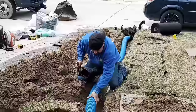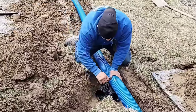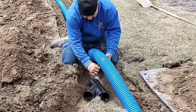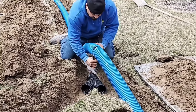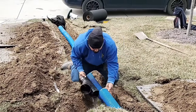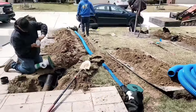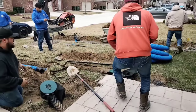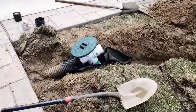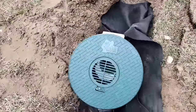After a rain event, once all the bulk water has been moved, we have it set up to leach into the soil. Always connect with a Y. I can't tell you how many videos I see on YouTube where they use T's — never use a T. The water just slams to a stop with a T. You want to keep water moving, keep the velocity up. Use a Y every chance you can. This is a roof runoff system and I want the water to flow freely, so use a Y in your yard drain systems.